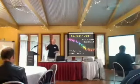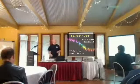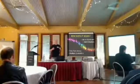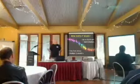DMX controllers have start channels. The hardware out there, they have those start channels. They're wired in, series is the wrong word, they're wired in what's called a multi-drop configuration. I think you want all controllers wired the same way.